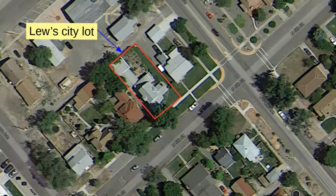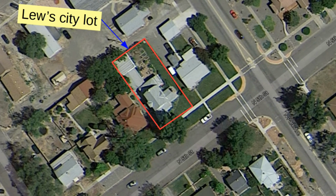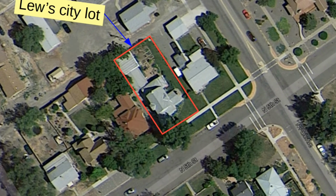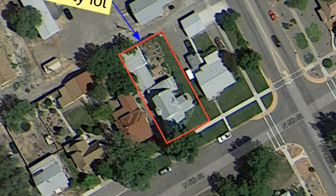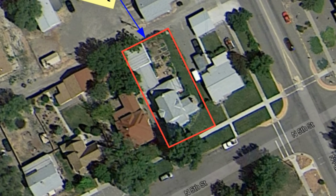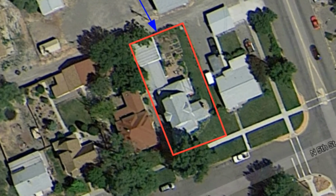And so really one of the first things I did was I drew a scale diagram of my lot and buildings and trees and power lines, and then sat and played with that for a while. And I found out that I had just enough room to put in an 80-meter full-length dipole.